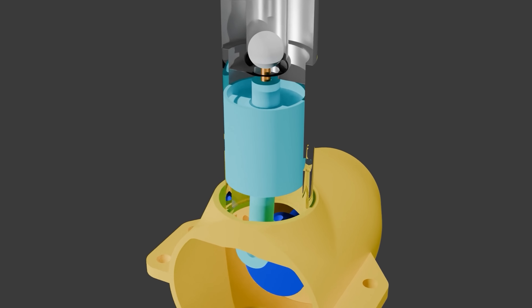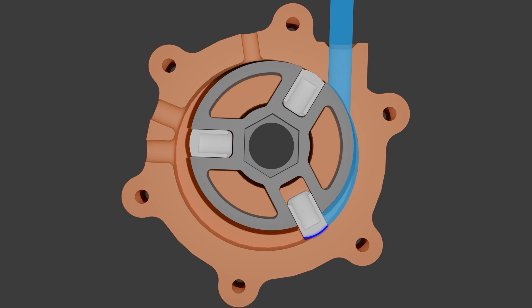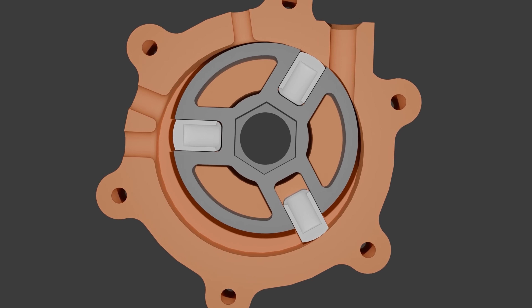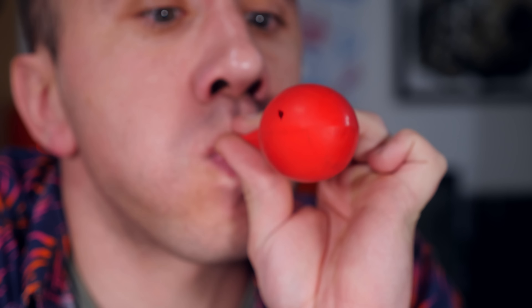I'm screwed. I can't believe I didn't think about this before — I was so quick to judge the piston-crank mechanism for its faults that I completely forgot about its biggest advantage: sealing. In a piston engine, the only moving place that needs to be airtight is one spot. In a vane engine, it needs to be airtight in five different places. With an inlet of only 0.8mm diameter, even a gap of 0.1mm at those spots gives a leakage area 5 times higher than the inlet. It's like trying to fill up a balloon with a massive hole in it — it's not gonna work.